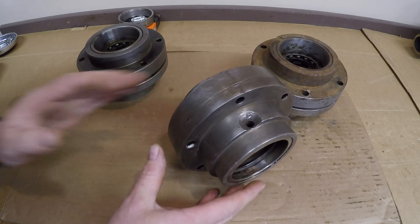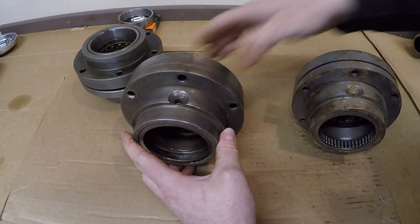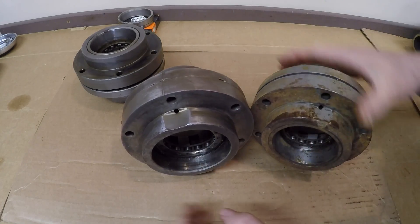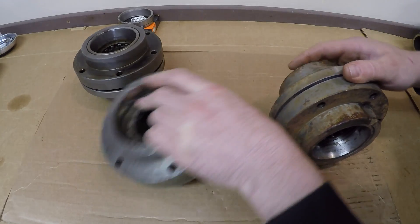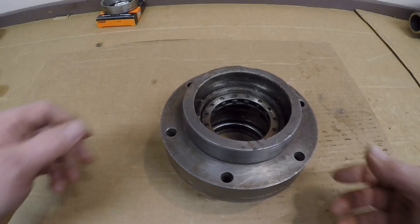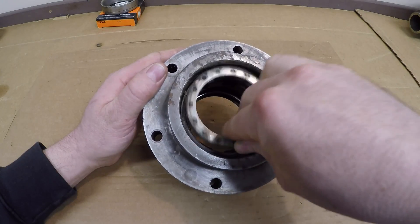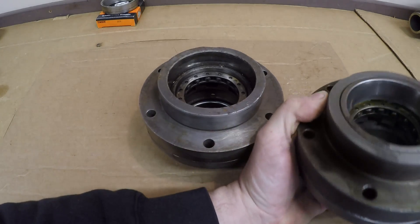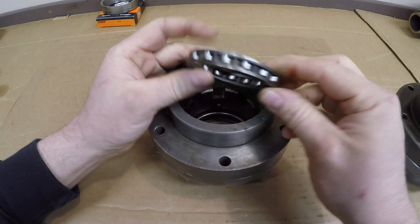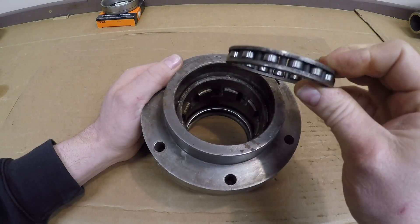Let's find the best example I've got. Side by side, we have oil feed holes in the same spot on the front as well as the back, diameters are the same, offsets are the same - pretty much dimensions all over are the same. Really no differences between the prototype and the production versions. Inside we have a Hyatt roller bearing with a race pressed in. I've been unable to find one of these anywhere, and I'm usually pretty well connected, but of the three I have here I'll pick the one that looks the best.